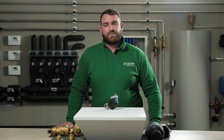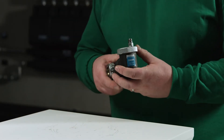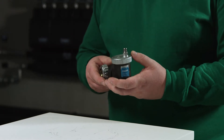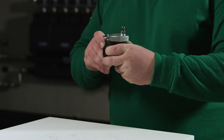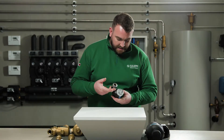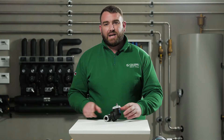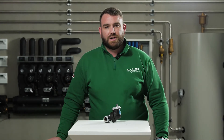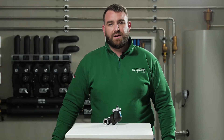Let's now focus on the features of the 551 Series Discal Slim. The Discal Slim deaerator is designed for continuous venting. The 551 Series can be installed in the horizontal or vertical position, and these are indicated by markers on the body. The circulation of fully deaerated water enables equipment to operate under optimum conditions, free from any noise, corrosion, localised overheating, or mechanical damage. It is important for reducing energy demands and ongoing running costs.